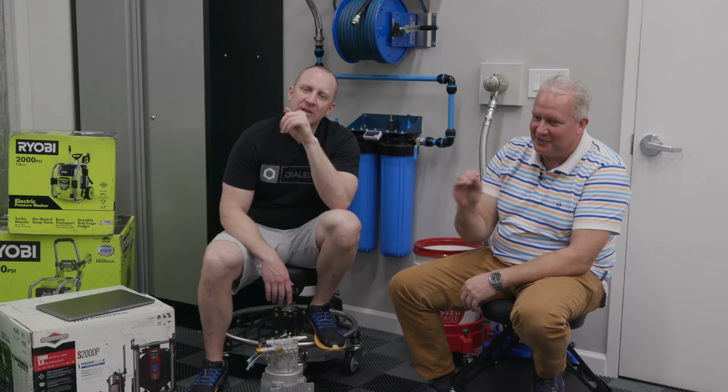But measuring wheel horsepower is not very accurate. I mean, the suspension setup and the weight of the vehicle and the horsepower and the torque and the temperature that day, all of those factors go into the performance of the vehicle, right? Whereas they can put an engine on an engine dyno in a room that's humidity and temperature controlled, with a certain amount of air flowing in. And that all goes into that PW101 standard.